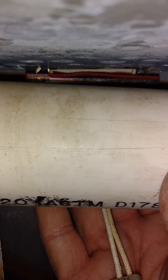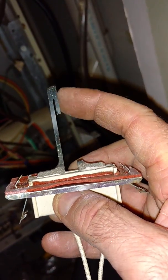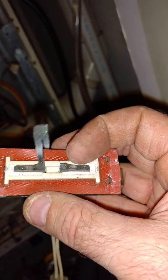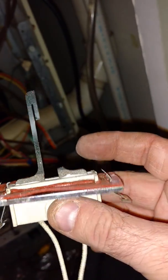How did I get it out? I reached into that little crevice and with a screwdriver I wedged it in between the body of the furnace and the orange colored gasket and twisted. It just popped right out with little trouble. Now, this thing was complete; however, there was a crack right there. With me goofing around with it, I cracked it off the rest of the way. It's pretty brittle stuff. And there's my hot surface igniter — no longer able to ignite.